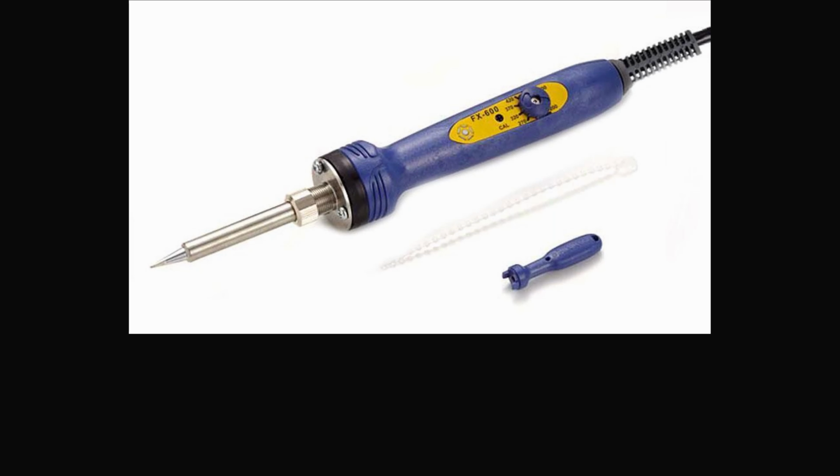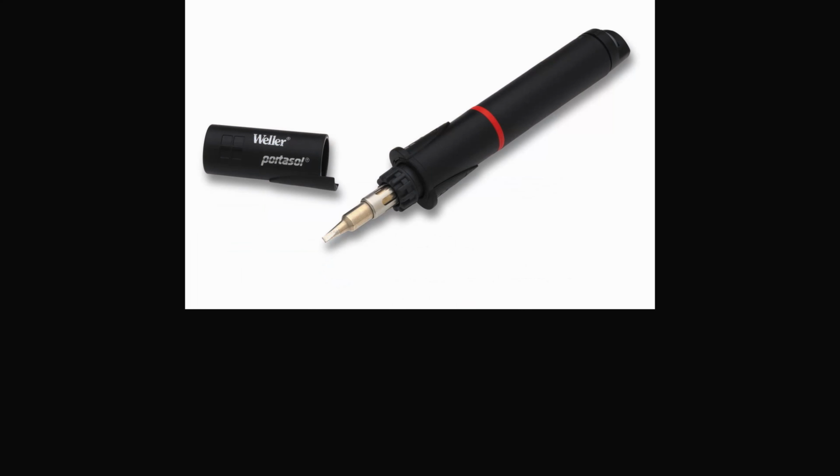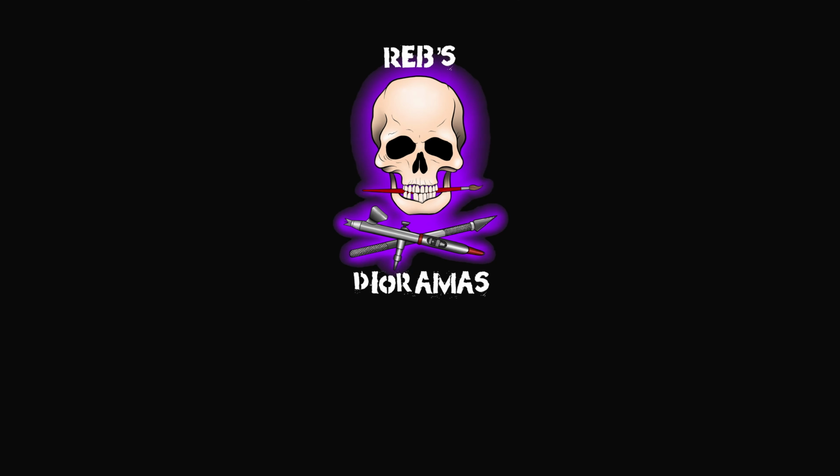With soldering we use what's called a soldering iron. The most common soldering irons are electric ones with heating elements. They can either come with fixed wattage or variable to change the temperature as needed. The more power or wattage put into the heating element, the hotter it gets. You can also get butane gas irons, but for electronic work on PCBs, those aren't used all that much because it's much harder to regulate the heat and you have a much higher chance of damaging the components. I'll go into more detail about soldering irons in another video.